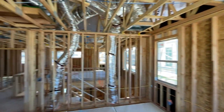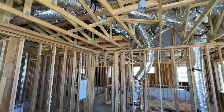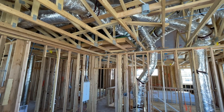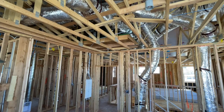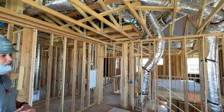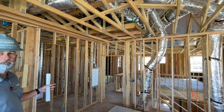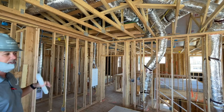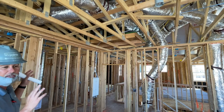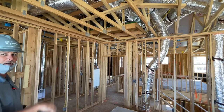So as far as that's the HVAC you said, right? Yes. Up there, you have two units. Is there a reason why you have the two units, one for one floor and one for the other one? It's pretty much all just due to square footage size. So okay, so many tons will hold so many square feet. Mm-hmm. Our smallest plan, which is like 2,200, only needs one unit, as a split system for upstairs and downstairs. This one being the more square footage, it's got I believe a 5-ton and a 3-ton, two separate units to handle basically the downstairs and the upstairs. Makes sense.